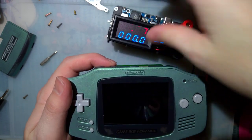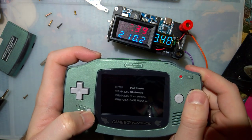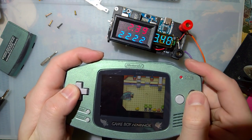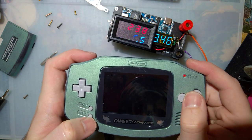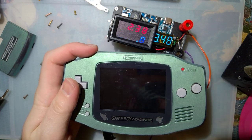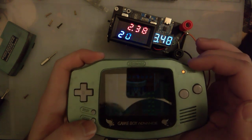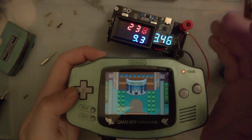I'm going to kill the lights. I can tell right off the bat that we're not on high, but I don't think we're on low brightness either. Going all the way down — holy cow, that gets really dark. I can't actually see that. All the way down is about 205 milliamps. I'll turn it one step up because that's slightly less ridiculous, and it's about 209.